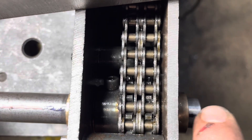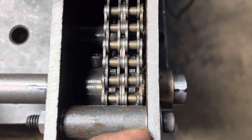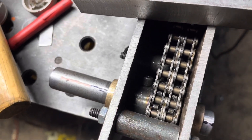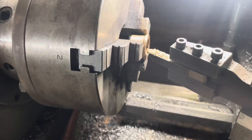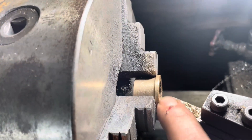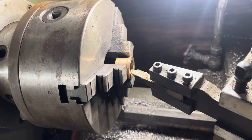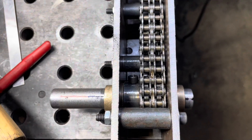We ended up with a little contact between the chain and the plate, so we added a sixteenth-inch thrust and then machined a sixteenth off the flange of the bushing. On our first trial run we had a little too much tension, which I believe was due to the thrust. We've taken two of the bushings and adjusted the thrust thickness to get the tension right on the inside. We'll reassemble and do another test run, but now we have plenty of clearance.